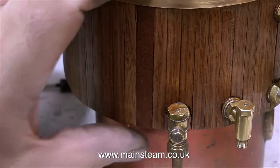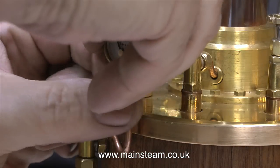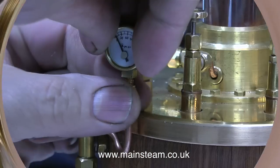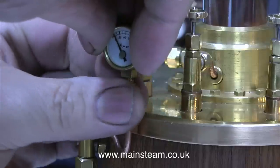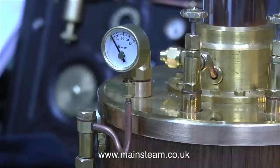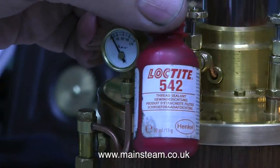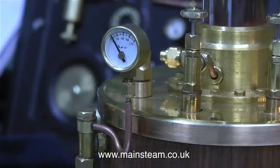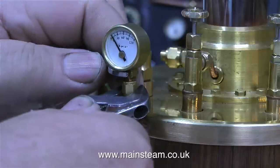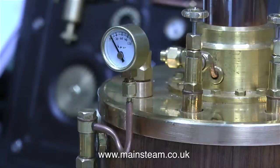In the loneliness of a cold winter's night, when I've got nothing better to do, I may change this for another piece of mahogany. During the steam test, I noticed a slight leak on the union to the pressure gauge — I tightened it up slightly and it disappeared as the test progressed. So this doesn't happen again, I spread a very tiny amount of Loctite 542 on the concave part of the union on the pressure gauge itself, applied using a very small screwdriver point. A useful tip for fitting pressure gauges: always use a spanner on the square part before you tighten the nut — this allows you to tighten the union nut thoroughly without damaging the pressure gauge.